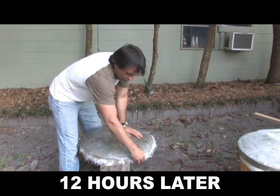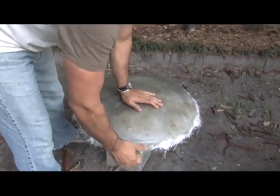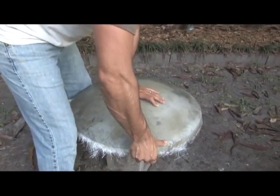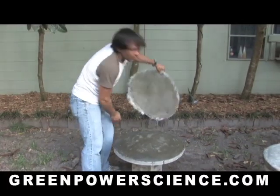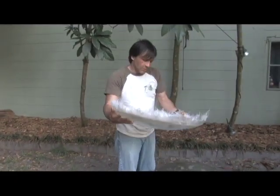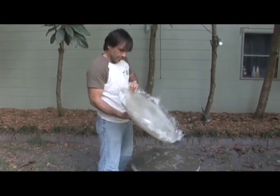We're back and this has hardened up pretty good, so we're going to see how well that release agent works and pull this off. You're going to see white areas lift up under there. You can see where it's releasing. That stuff worked great. There you have a parabolic dish completely done. We're going to let this harden up a little more, then sand the inside and trim around the edges. That took about 12 hours to do. You can see we've got the nice shape. It's got a little bit of resin left behind, but we'll just sand that down and wax it up.